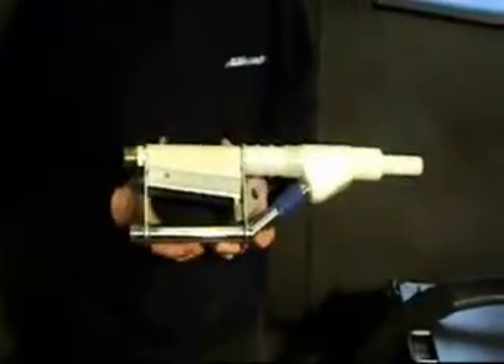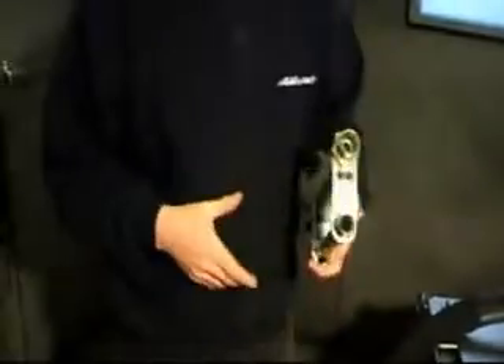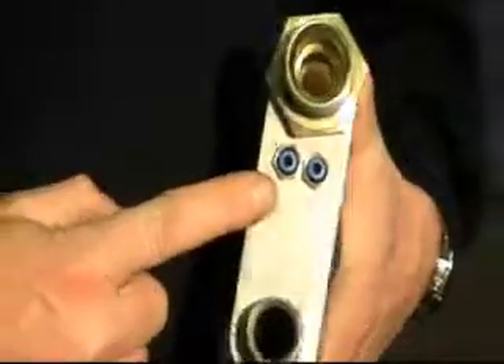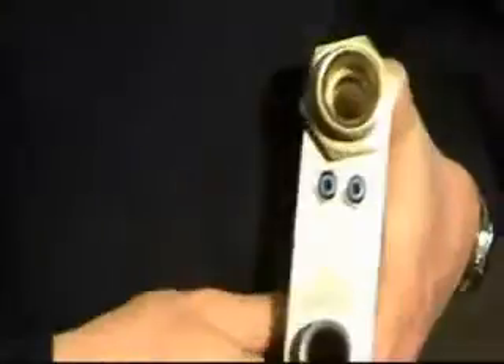That is the main difference between the SMC type nozzle and the Festo type nozzle previously shown. On the back of the nozzle there are two 4mm connections, of which we connect the two trigger tubes in exactly the same format as on the back of the machine — with the 1 inch connection at the top and the 3 quarter connection at the bottom. We connect the blue tube to the right hand connector and the black tube to the left hand connector.